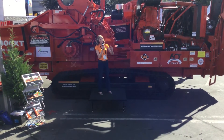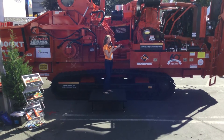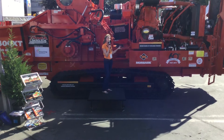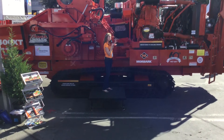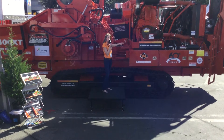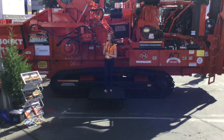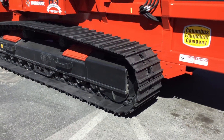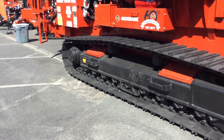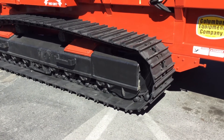When you need to perform maintenance, you can do it more easily on our extended platform. We've reconfigured the area between the hood and engine to provide an additional 12 inches of working space, so you can more easily access components for general maintenance or to change screens. The 3400 XT is available with either Strickland or CAT undercarriage options. This particular unit has Strickland tracks, but this model can also be manufactured in a trailer or stationary unit.